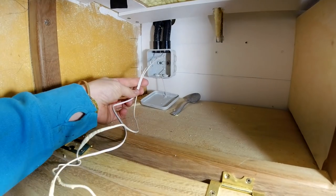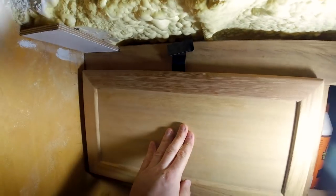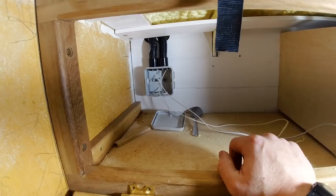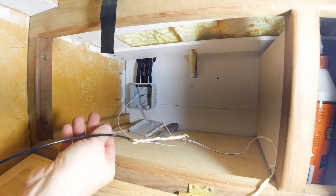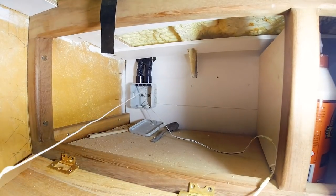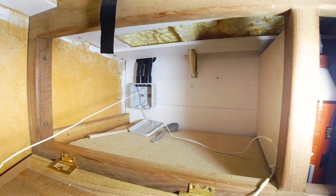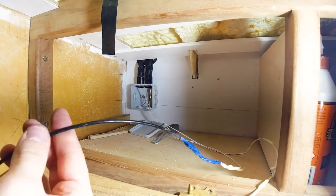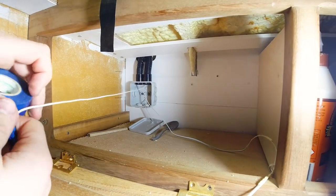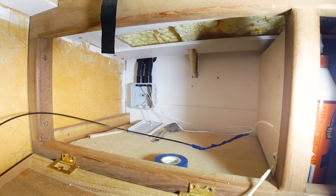That's pretty tidy — these are used to pull cabling through. When the door's closed you'll never see the wiring. I'm taping the fish wire to the pull wire that I already have in the conduit. I pulled a wire through the forward cabin a couple of months ago and the pull wire cracked, but I managed to get the fish wire up — this really nice strong fish wire with a proper end on it. What I've started doing now is I pull the fish wire through using the pull wire, then pull the cabling through with the fish wire, and it just makes a lot more sense.